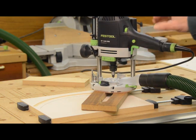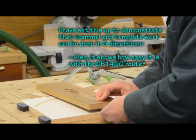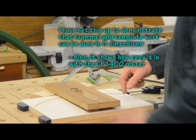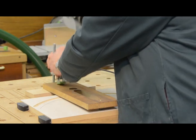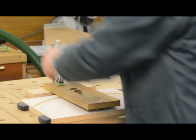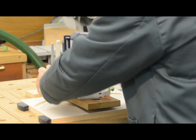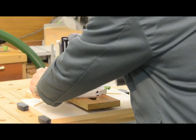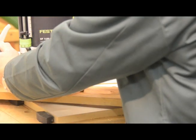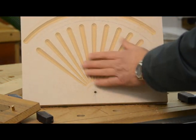I've done my v-cut for the fancy work. I've now got a nut about 10 millimetres thick which I've put underneath this end of my trammel. I've already marked some places off on a circle where I want to set this up, and I'm going to do a little bit of fancy work. I set my depth at 6 millimetres, make my plunge, and let's take a look at this. Remove the trammel — and there we go, a rather nice little pattern. Quite good really.